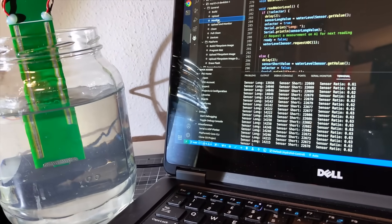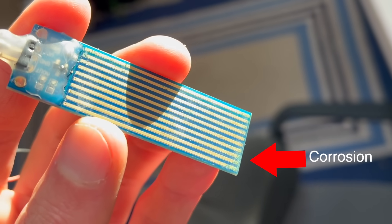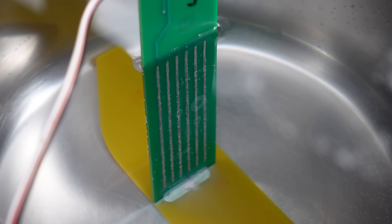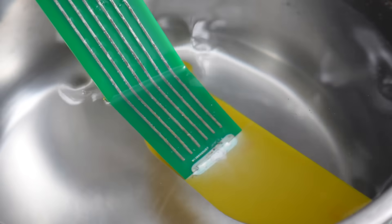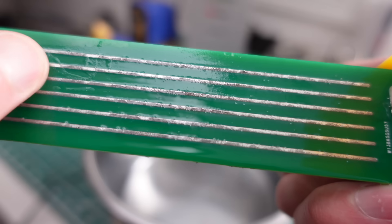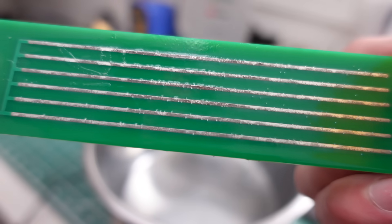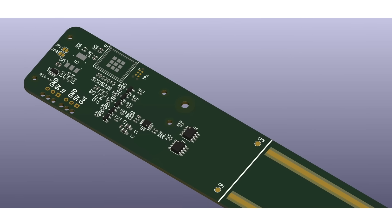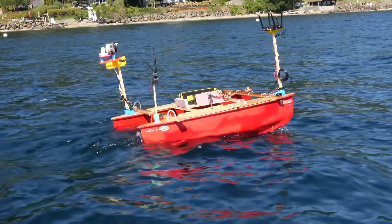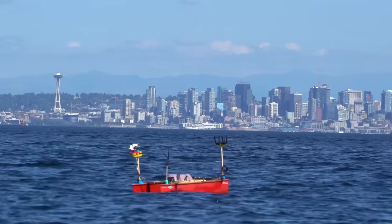When you run electrical current through bare metal underwater, it will corrode the metal away, and the H2O will get broken down into just H and O. That's what these little bubbles are. This sample had been powered on in slightly salty water for 24 hours. You can see how the once shiny metal turned gray in some areas as it was corroded away. We had hoped that reducing the electrical current would eliminate the electrochemical corrosion, but just a few months before, I had the resistive liquid level sensors on my autonomous boat get completely destroyed due to corrosion.